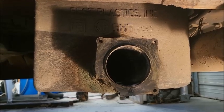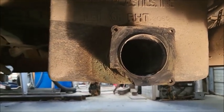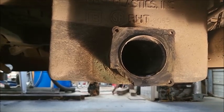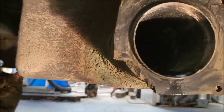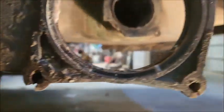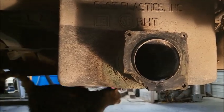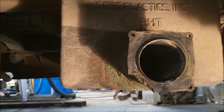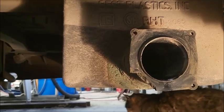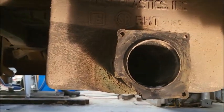I put it on the quarter-inch bolts to pull them off. All four had been rusted for 23 years and there wasn't any anti-seize lubricant on them — they all broke. A corner broke off, and you can see even on the valve there's some broken damage. It's possible I could have just cut those bolts with a Dremel, cutoff tool, or hacksaw. Maybe they wouldn't have broken, or maybe that was already my leak — maybe I caught a rock on that corner and it was already broken.